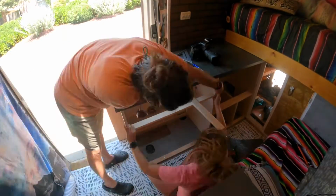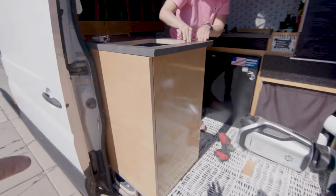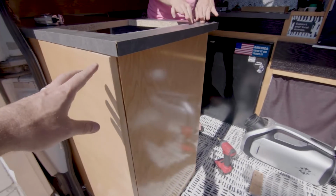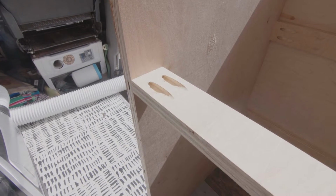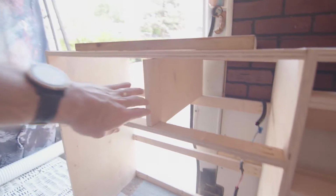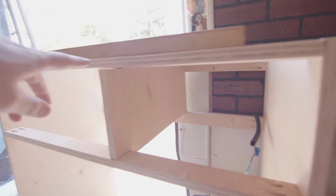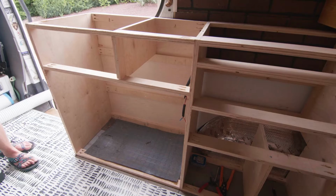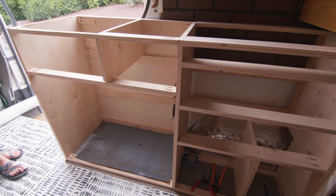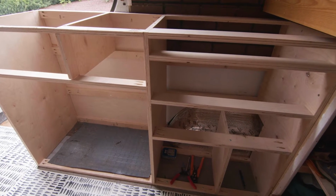And then this here we added a back, so we cut once again with our straight edge tool and added in the back and stained the sides of the cabinets as well, also attaching our supports to the sides of the cabinets, and we even added in a little material here for drawer sliders. So once you have all your mid rails, headers, footers all attached, your cabinet should start coming to life, and you should have a nice frame of your cabinet all well constructed.